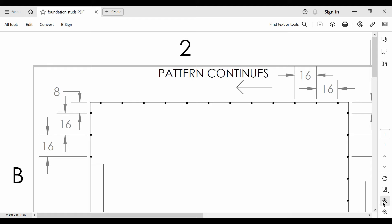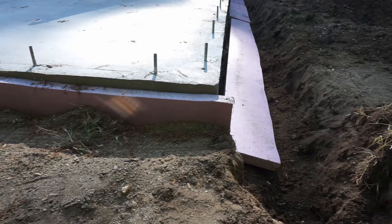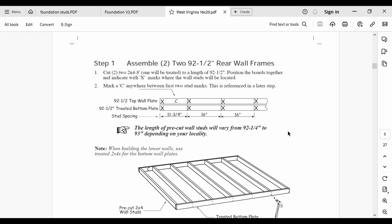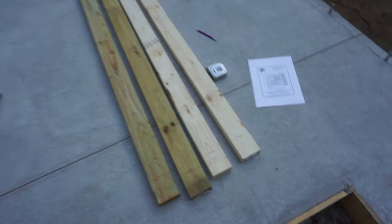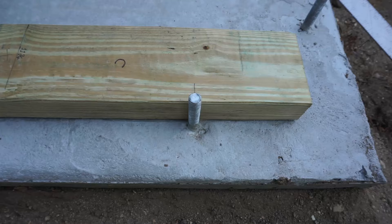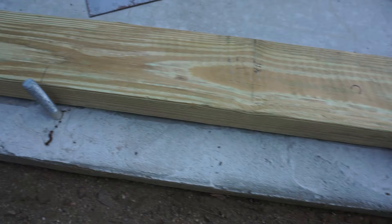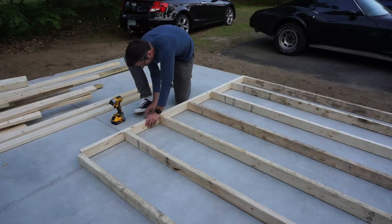I also created a document to show the contractor where to install J-bolt cast-in-place concrete anchors. These anchors are cast into the concrete and used to hold down the frame of the building — the amount I specified was definitely a bit overkill. Now let's get into steps 1 and 2 from the building instructions, which are to build the stud walls for the back wall and the rear half of the side walls. Just add markings to the specified 2x4s as shown and assemble accordingly. Make sure you use pressure-treated wood for the bottom of the stud walls where the wall makes contact with the foundation.